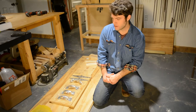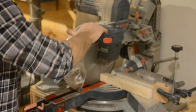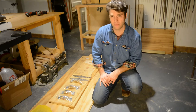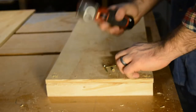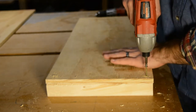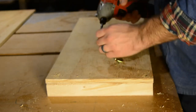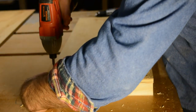Once I had that going, I used a miter saw to cut the 2x2s to length, and I've got everything set up and I'm just about ready to assemble. On your two ends, take them and place them right on top of the struts, and fasten them to the struts using some construction screws. You can do three screws aside — that is my recommendation — though you can get away with two.